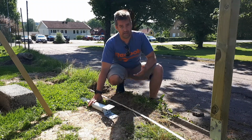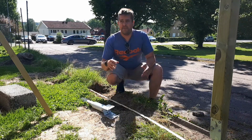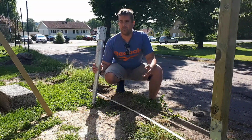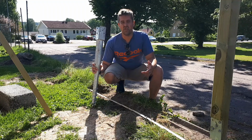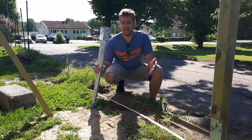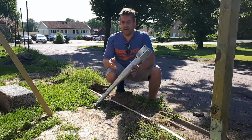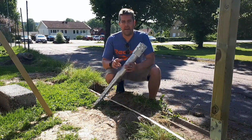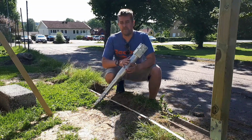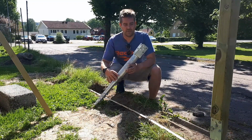I could have taken 2 meters, I could have taken 1.5 meters. But at 2 meters and above, the distance gets a little bit too wide on the screws. Remember, it has to withstand storms, snow, stuff like that. And if it's too small, 150, then I have to do so many of these. So you have to find a balance between the economy, where you want to buy as few as possible, and having as many as possible to withstand the passing of time, the storms and everything.